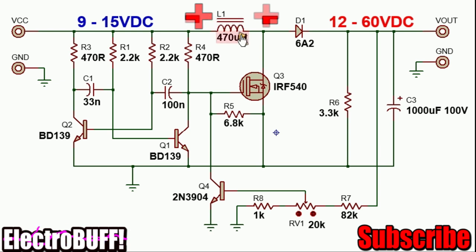Because an inductor tends to keep current flowing, this will cause the potential across it to reverse, with a negative on one side and a positive on the other. When this happens, diode D1 will be forward biased, with the inductor and input in series configuration. When diode D1 conducts, it will charge the output capacitor C3. Resistor R6 is a bleed resistor which prevents the output capacitor from overcharging and also discharges the capacitor once the input has been withdrawn.